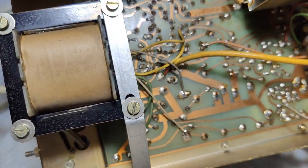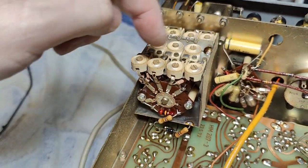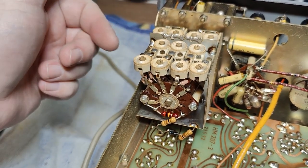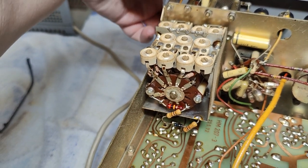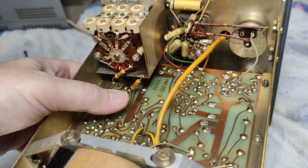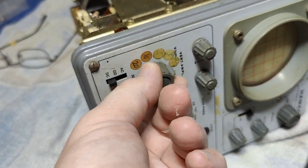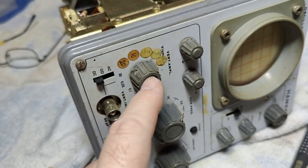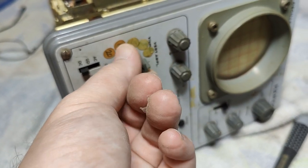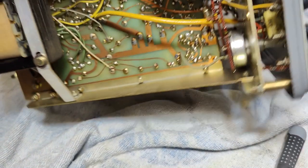It's a glass fiber board, and we've got trimmer capacitors over more or less each of the resistors in the voltage divider for the input attenuator, so you can tune this for maximum. There's a little thing about speed — this one is supposed to have a 7 megahertz maximum vertical bandwidth, but it can be as low as 1 megahertz depending on the settings.